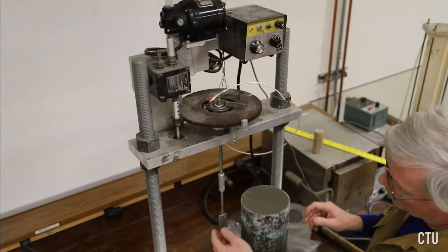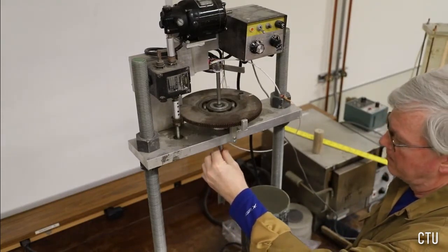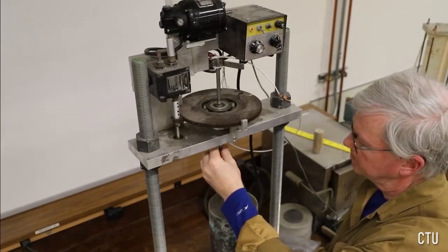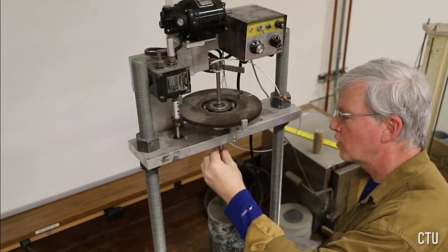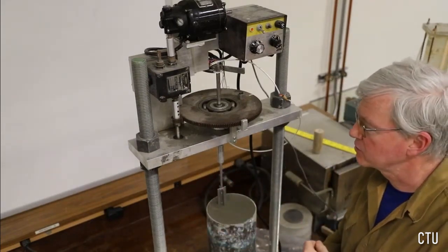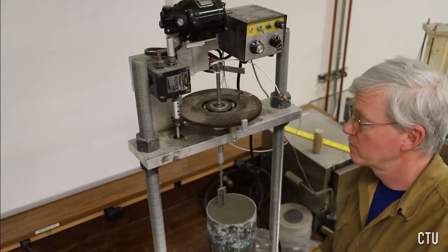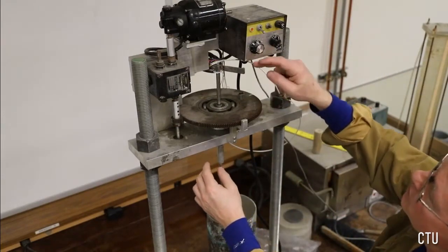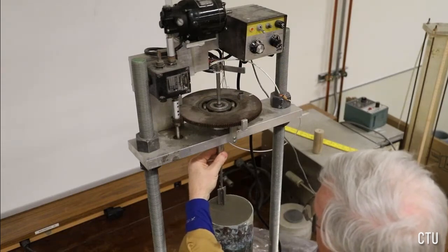So in order to insert the vane, we need to lift it up out of the way, slide the specimen underneath, and place it down. We don't want to be too close to the sampler edge, or we might be in material that's disturbed from the sampling process, but we also want to stay away from the middle of the specimen, or we'll disturb those other quadrants that we want to save for later. So we'll put it there, and we're going to insert it with some space between the block and the rod. I'm going to center it left and right a little better here.